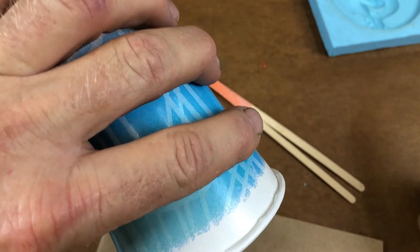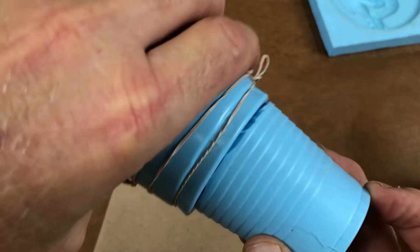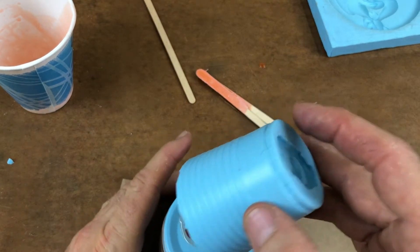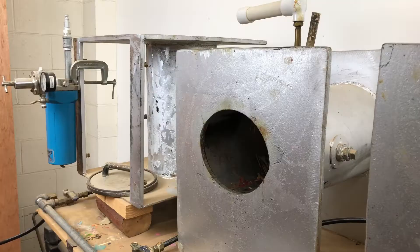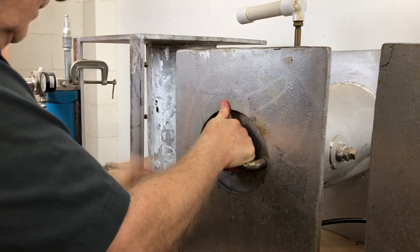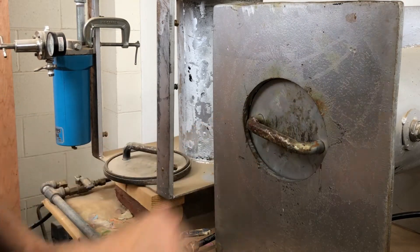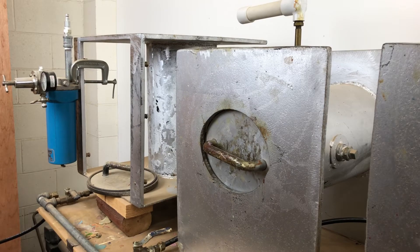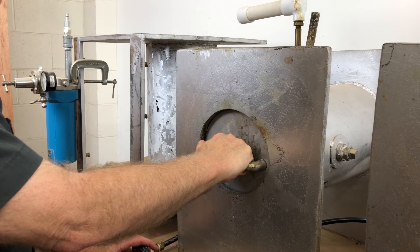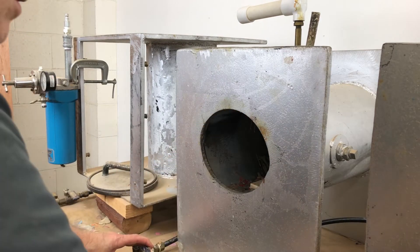Here's a trick: take a smaller mold and use it as a cap for the mold you're currently pouring. Now I'm doing the shake and rock and roll thing, hoping to get bubbles out of the face details. Into the pressure pot it goes — we'll let it sit under about 80 pounds per square inch of pressure for 20 minutes, then let the air out and pull the casting out.